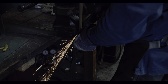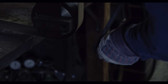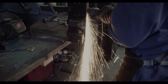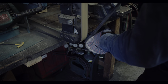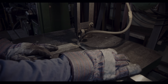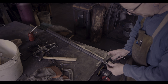I have finished all the forge welding now and am using the rubber wheel on my belt sander to create a completely flat surface. This would be a good test to see if my welding was successful. I am also cutting off one of the ends to inspect the welds there as well. As you may be able to see, everything looks quite good. With that successful experiment under my belt, let's go back to the sax.